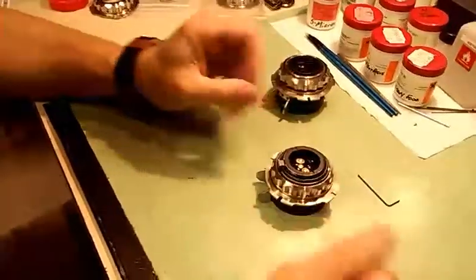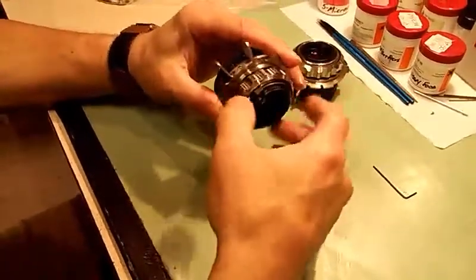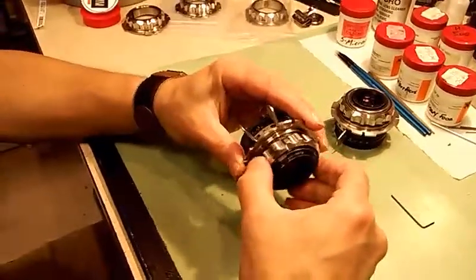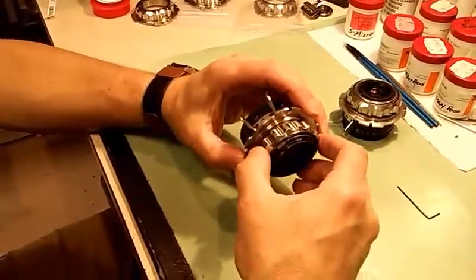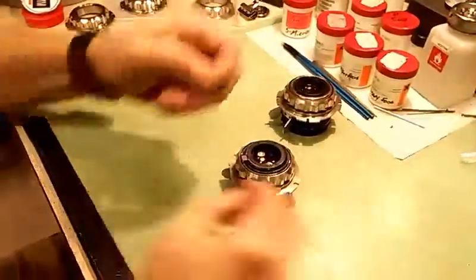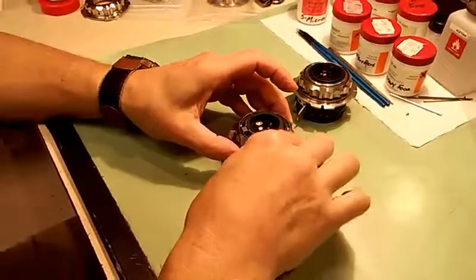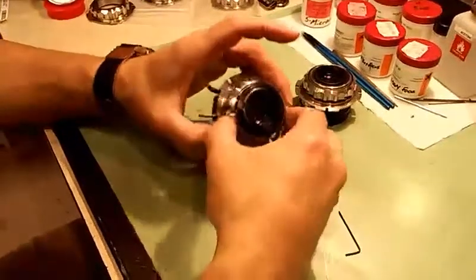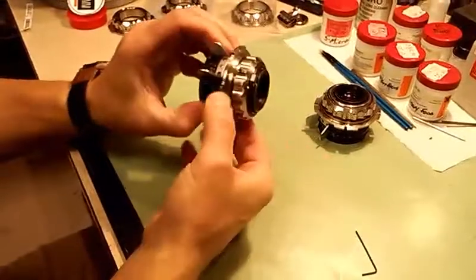I'm going to snap a snap ring on it just like I did on the last one — you can see the opening goes right on either side of the key. Now with this one, I'm not going to tighten it up like I did the other. I'm going to just back it up to where it's just touching. I don't want to crank it back because it will lock up the focus. I'm going to do the same thing with the set screws — add the four set screws and just touch them. I just want that ring to not rotate. I don't want to crank it down because if I crank it down it's going to lock the lens up. We want the lens to be able to focus smoothly.